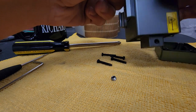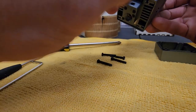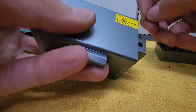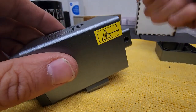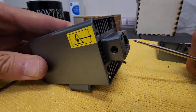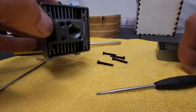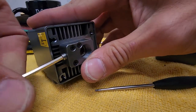Inside of here on the side, when you're looking at it, there's a hole right there and this set screw — which you can see I didn't do a great job of cleaning when I pulled it out, but it's been set in there so long I've got a lot of crud built up. It's right here on the side of your laser. You can follow it by looking through the threads and you'll see a silver plug if it's in, because it's all the way screwed in. I'll put it back in and show you what I mean, which is why I missed it when I was assembling.